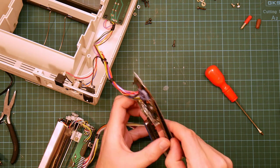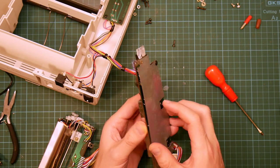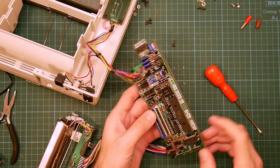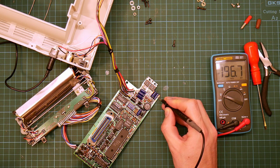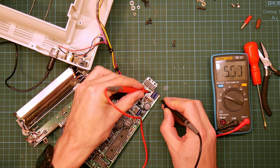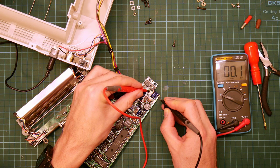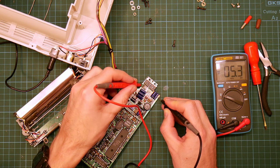This metal shield is clipped in. I'm going to assume that this copper thing is ground, so let's probe some stuff and see what happens. Let's try the voltage regulators first. Five volts, dead on. Eleven and a half input — that's the DC supply. Five volts is the output. That is working just fine, so let's try this one.